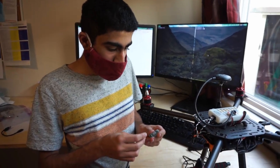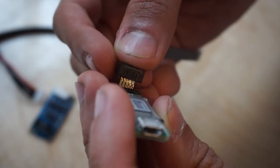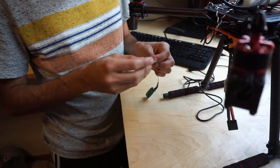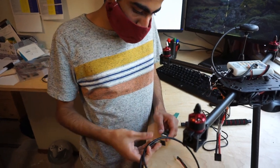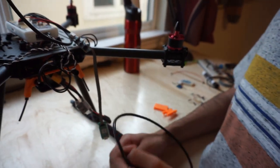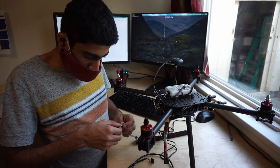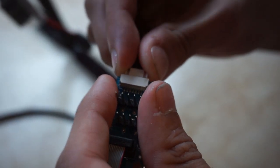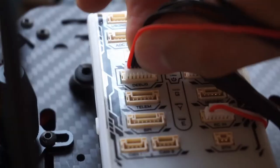To connect this debugger to our flight controller, plug the 10-pin SWD cable into your J-Link debugger and plug the other end into the breakout board. You can also use the USB to TTL cable provided — plug this into the FTDI port on the breakout board to access the system console on the FMU, though this is not required right now. Use the JST GH cable provided, plug it into the breakout board, and connect it to the debug port on the FMU.